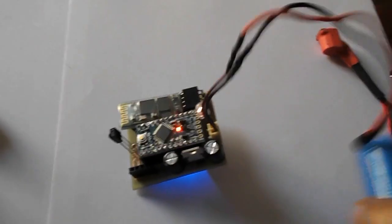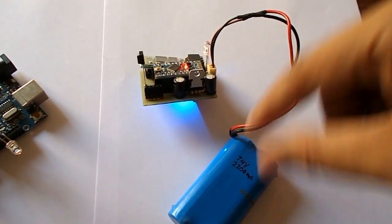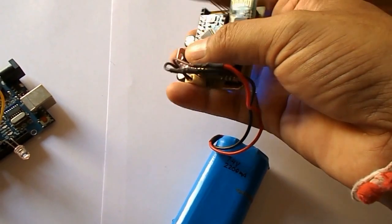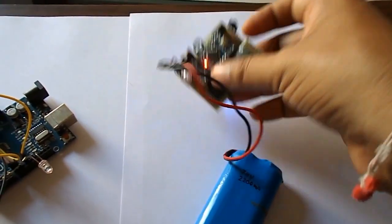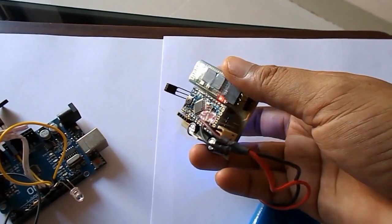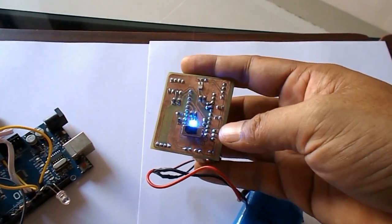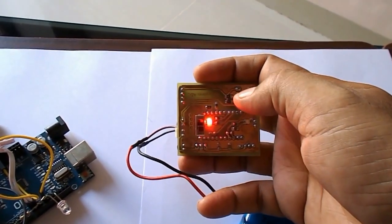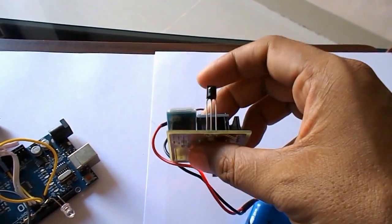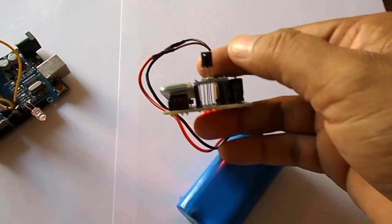Here it is — the things are ready. I've connected this small project with a battery. And here it is a 5V voltage regulator which is converting the 7.4V into 5V to use with this device. Now I'll give you a demo of how it works. It has two options using this switch — in one condition it will be in recording mode, where I'm able to record the infrared remote control using the infrared sensor.